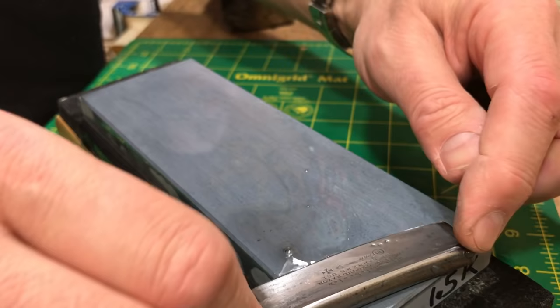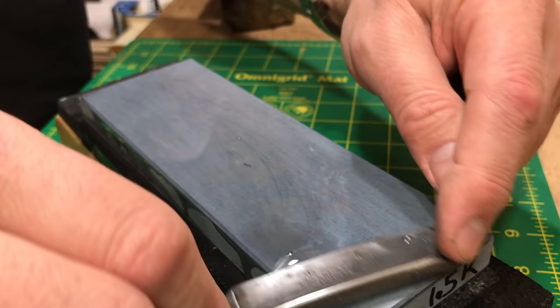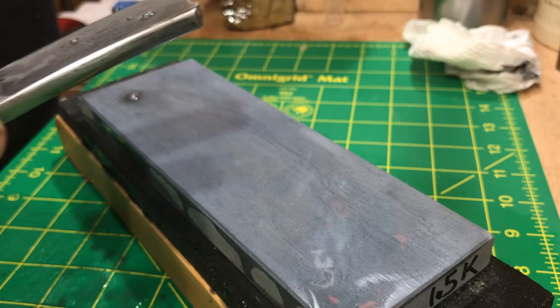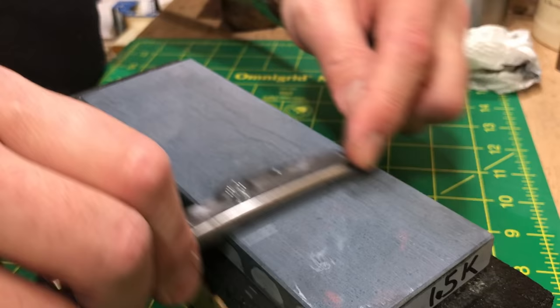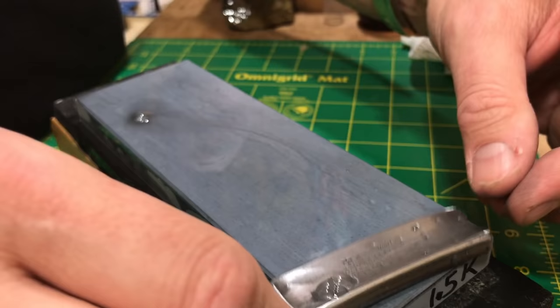If the angle is too narrow you could run into a situation where the steel fails because it won't hold that edge. If it's too fat you risk a razor that shaves poorly — though people with easy shaving needs and soft beards who do one pass with the grain may be okay with that. For me, with a big blade like this, no way do I want it anywhere close to 19 degrees — that's just been my experience.